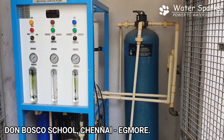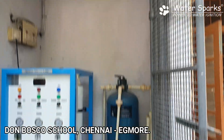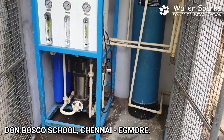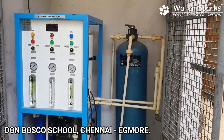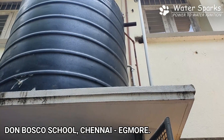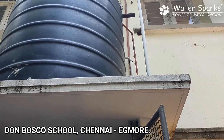Because of the high-pressure flush, the accumulated salt on the membrane is flushed out, so anti-scalant is not required at all and the membrane lasts much longer. In fact, this plant is 12 to 14 years old and we have not even changed the membrane — it still works absolutely super.